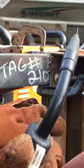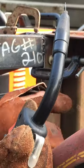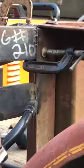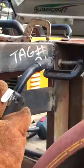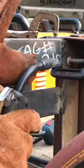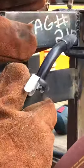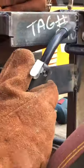The end of the wire is melting and arcing, which helps bond that side too because it's melting into the middle there. If I don't sway back and forth there is a little gap — I need to fill that in. If I just stay in that gap, the arc is just bouncing back and forth between the two. I need to sway it back and forth to get both sides instead of just wherever it wants to go.